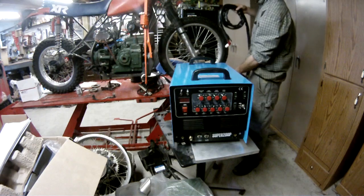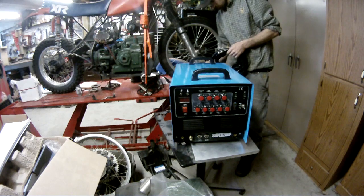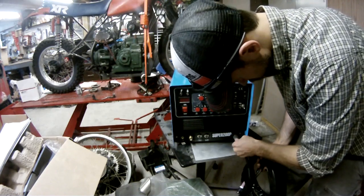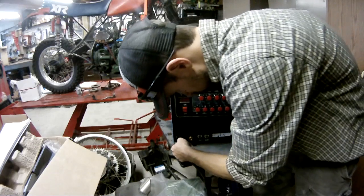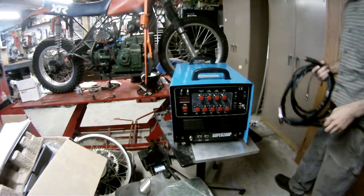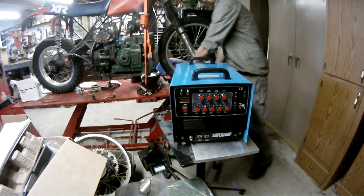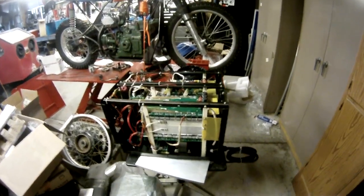It says AC output frequency 50 Hertz. I wonder if that's 60 Hertz for us who use 60 Hertz power in, or if it's probably just 50 Hertz coming out, because it rectifies it to DC before it creates the AC again, I believe. So AC output 50 Hertz. We got AC clean width percentage 20 to 80. Not exactly sure what that means. Chime in if you guys know. Leave it in the comments.